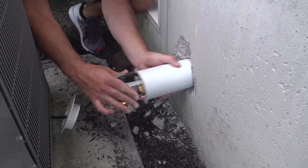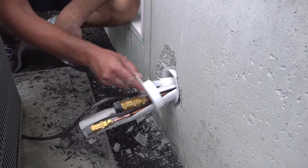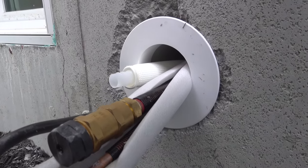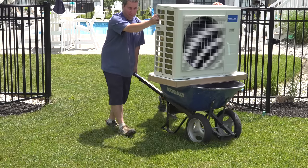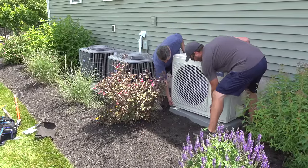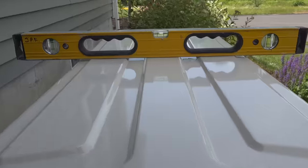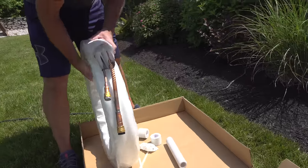Once you're outside, things get a lot easier. Start by sliding the collar into the hole to protect the cables, then finish with the trim plate. It almost covers the concrete damage, though he'll patch that area later. These units come in a lot of different sizes and this one's pretty heavy, so a wheelbarrow made it easier to move from the driveway. Set the outside unit down on the pad you already put into position and check that it's level — it's easy to adjust the pad to get it perfect.